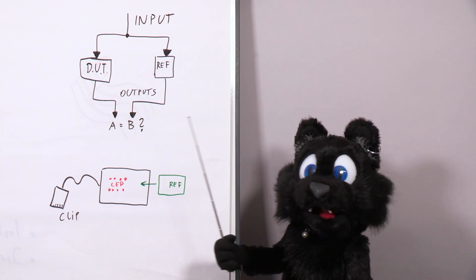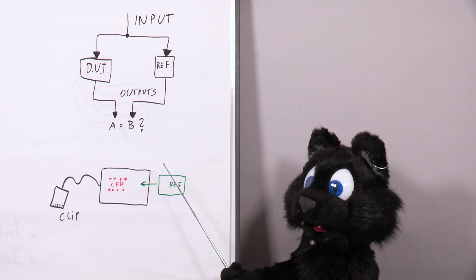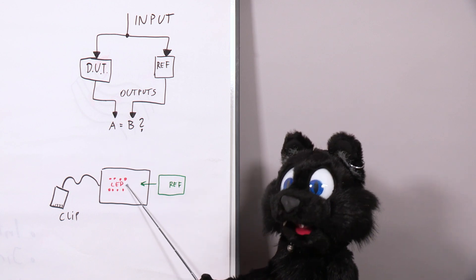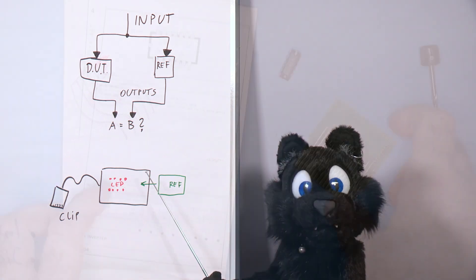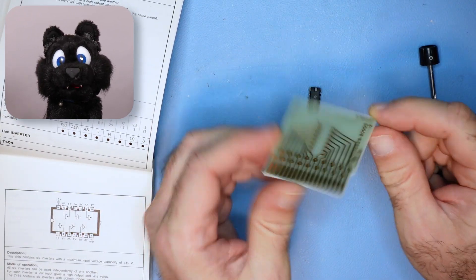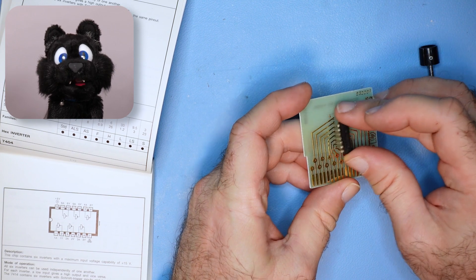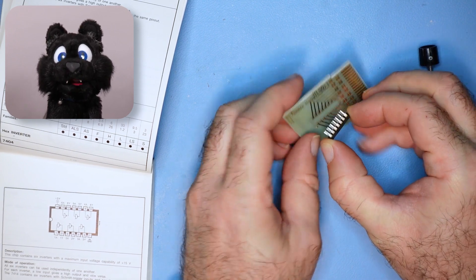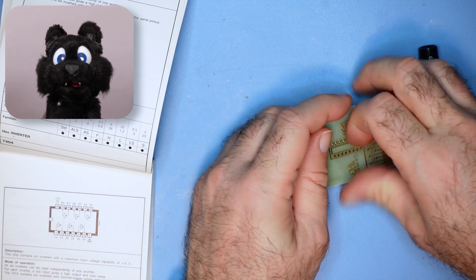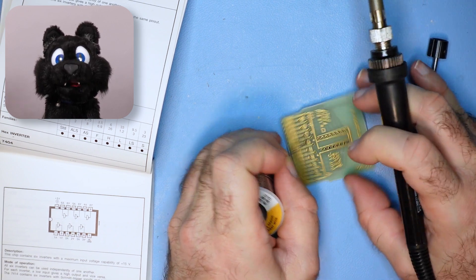The comparator has an IC test clip on a flexible cable on one end, which hooks to the IC under test, and a tray to put in the reference IC on the other end. In between there are 16 LEDs that indicate different state for each pin. Originally the device came with 10 reference IC cards — small PCBs that can take one IC and fit into the holding tray, connecting up with the card edge connector inside. You would solder your reference IC onto that card and drill out the vias for all the output pins, so that the input and power lines stay connected on both sides, while the output of the reference IC only goes to one side of the card edge connector.